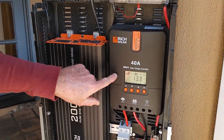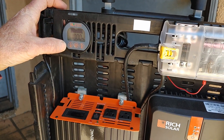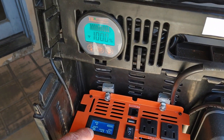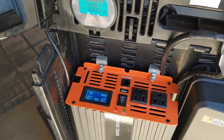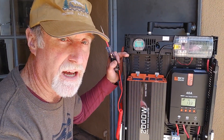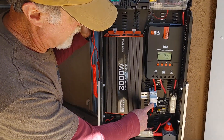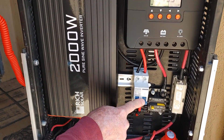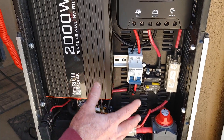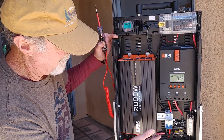It's all powered up. This is the charge controller — it's powered up. This is the battery meter reading the battery. If I turn the inverter on, it'll show how much battery charge we have — looks like it's about full. I want to plug in the solar panels first to get a reading on power input. This is the solar panel input to the charge controller. You want a switch on this so you can isolate your solar panels, because they're always generating power and you don't want that coming in while you're working on it.